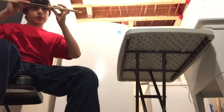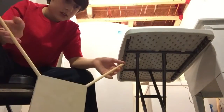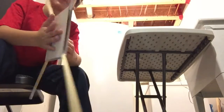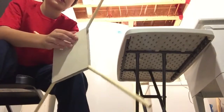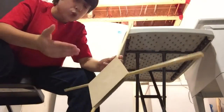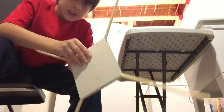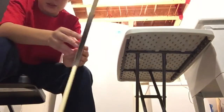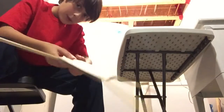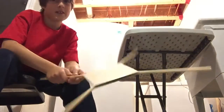I used a mixture of hot glue and wood glue, and I put little slats on top to sandwich the pieces together. They're birch wood — I was going to use balsa wood but when I held it, it felt spongy so it wasn't going to be very strong. Birch is still very light, super thin pieces, barely adds any weight but adds tons of structural strength.